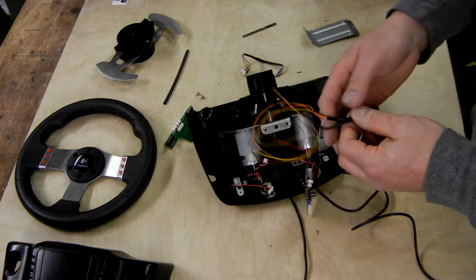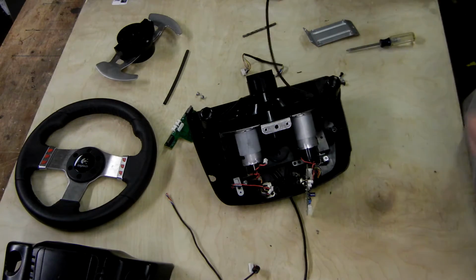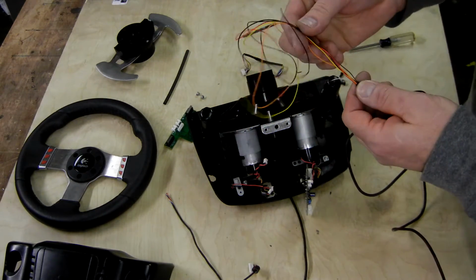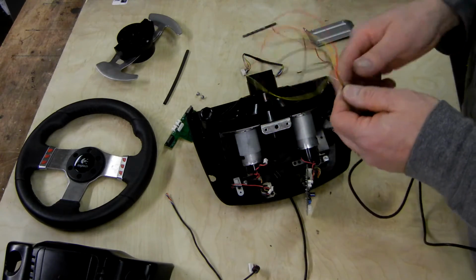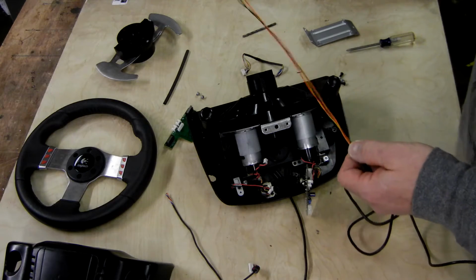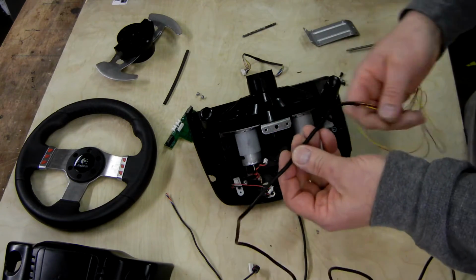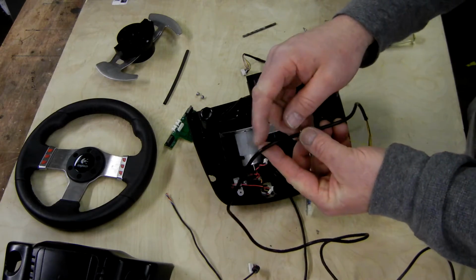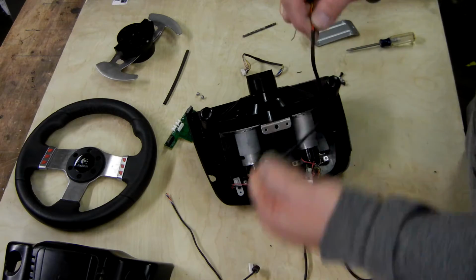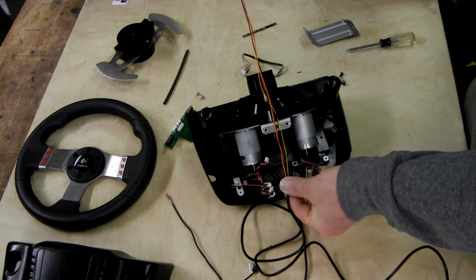Now, for the wire that I'm using, it's an extra wire from a DIN plug PS2 connector. This is a 5 conductor. I need 4 conductors, but I'm going to go ahead and run all 5 if they'll fit. That way I have an extra. And to strip this down, just take a hobby knife or some sharp knife and very lightly scribe the casing, and then you can just pull it off. But I've left plenty of extra for myself to work with here.